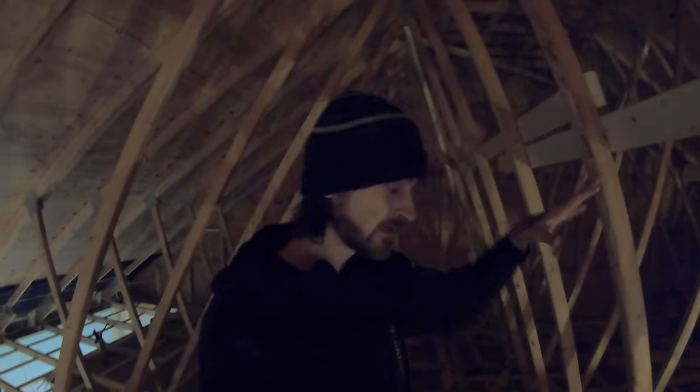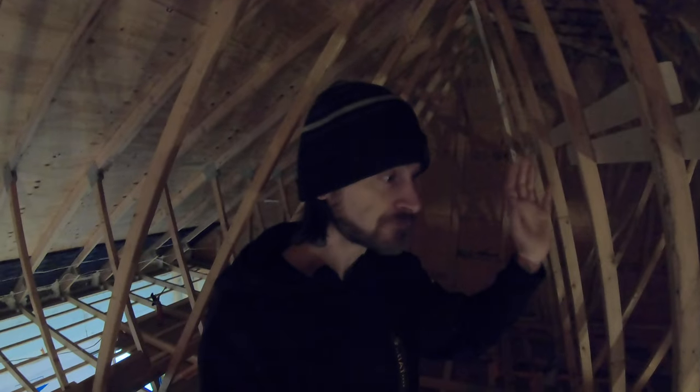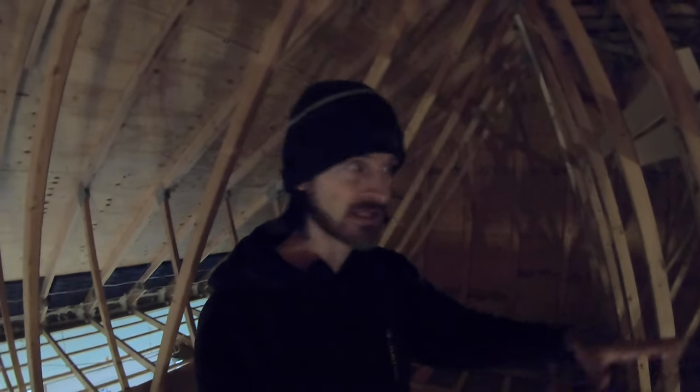So with vented soffits, and putting the insulation on the top of the drywall, no matter what it is, whether it's batt insulation, blown in, or open cell spray foam, again, so you aren't creating condensation issues, and then more blown in cellulose or something, that's a much better way for us to go just because of the huge cubic volume that we have up in here. And again, we're making the local codes happy by achieving at least a minimum of an R49 instead of trying to get away with an R49 of some sort of closed cell spray foam on the other side of the decking.